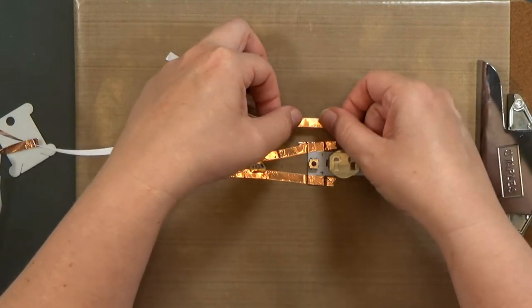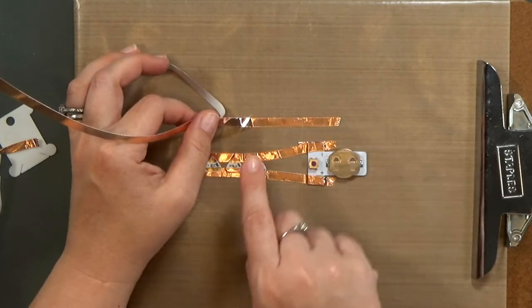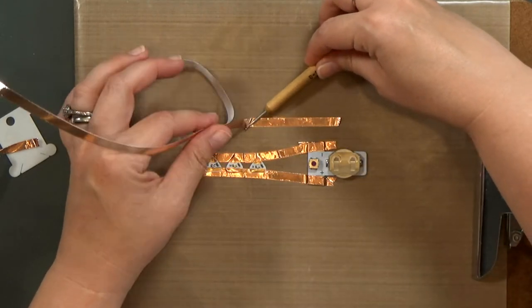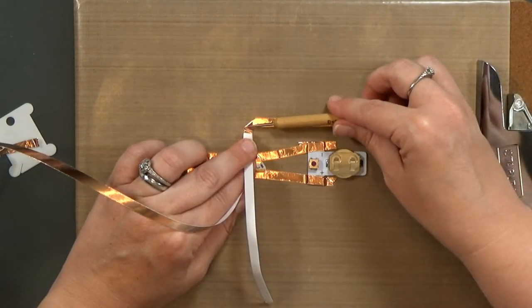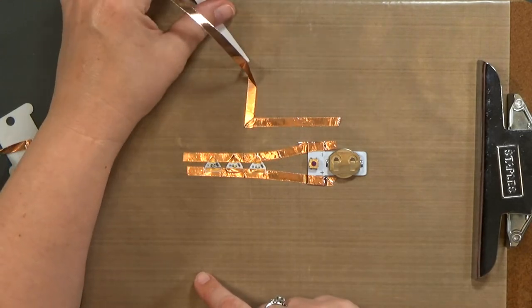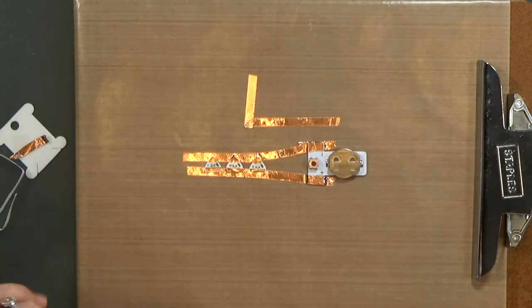Okay. Now, another way to reduce resistance is to avoid breaking the lines. So you can curve the tape gently or you can fold it. And folding it is probably going to seem a little bit weird. In this case, I want to change the direction of my tape and make it go up. So first, I'm going to fold it in the opposite direction. I'm going to fold it down. Then I can fold it again and go in the direction that I want. This keeps the sticky side all down flat onto my surface there. If you just folded it once, you'd have the sticky side up.